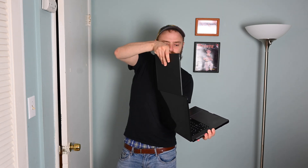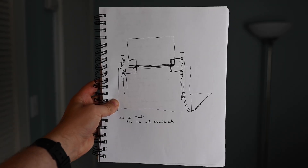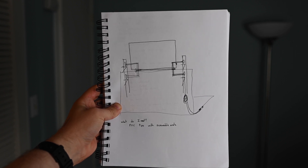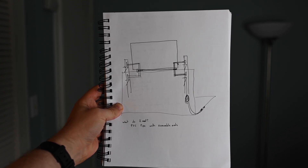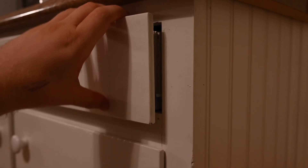So this is the motion it needs to go through, and it's obvious that we need some sort of sliding mechanism to switch between positions. I spent a lot of time on this and came up with a system of little rods that can slide up and down within a tube, but it would have taken a lot of effort to build. Then I thought, somebody has to have invented sliding doors before — and it turns out the thing I was looking for are drawer sliders. They're those little metal pieces that sit on the side of sliding drawers so they can open and close along a track.